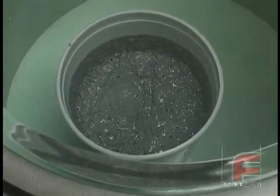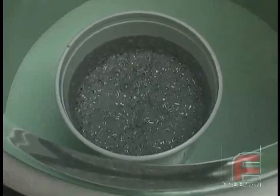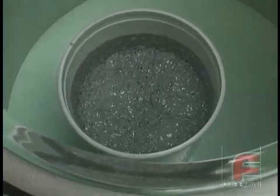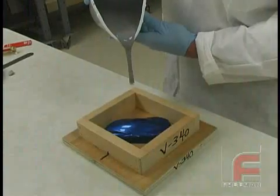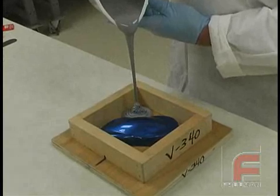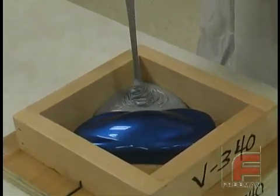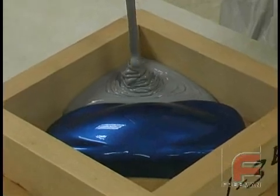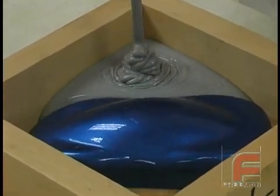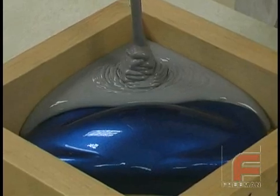If you choose not to degass your silicone, you should be careful not to stir the base and catalyst too vigorously, and you should never use a mechanical mixer. When pouring a silicone rubber, you want to pour it at a low point first. Notice that this is thicker than a urethane like Repro. When you pour the material, you do enter a little more air into the mixture, but these bubbles will break on their own.